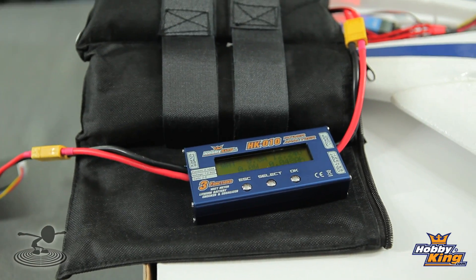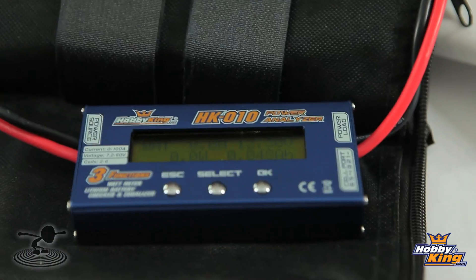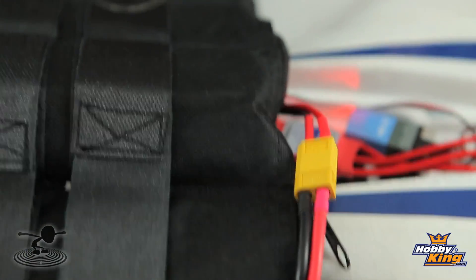You know what we've learned because of this little guy? We need something that can deliver at least 25 amps of continuous power. If we put something too small, basically your battery's going to drain too quick and discharge too quick, and that's not a good thing.